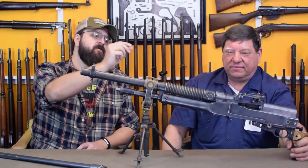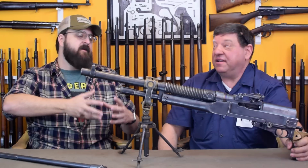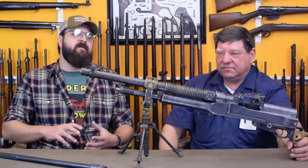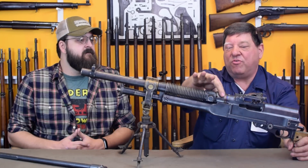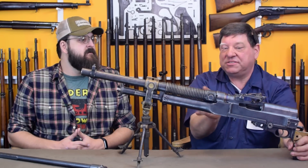Right. That you can work this gun at a headspace because resetting the barrel counts for a lot. And it does. That was a very common field complaint, that the gun would start malfunctioning. Well, really what it was is they hadn't set down the new barrel. And it's not as firm of a twist. It's not an interrupted screw. You just turn it and it's locked in. It's a feel thing, and it's supposed to stop up here on these detents. And you can see that it's been over rotated almost one entire turn to get it to take all the slop out of it.